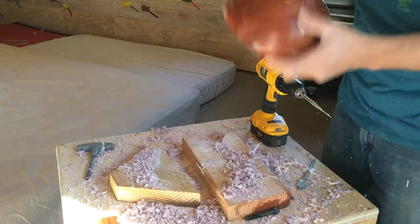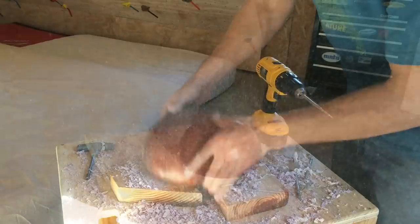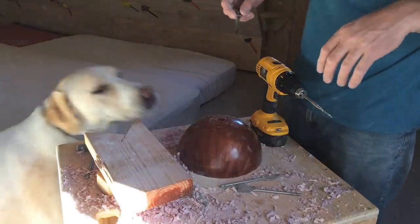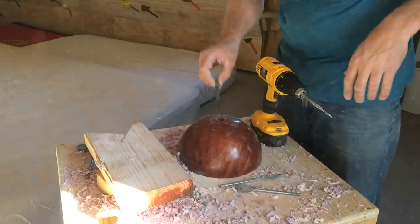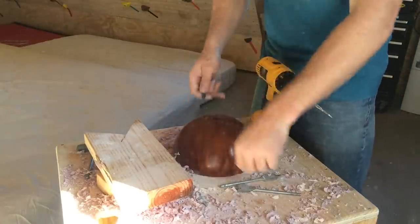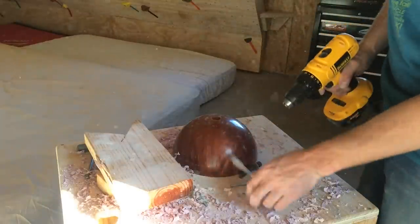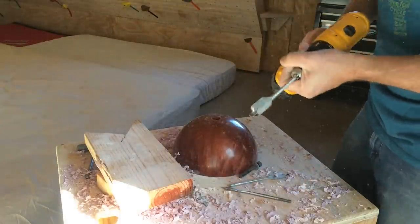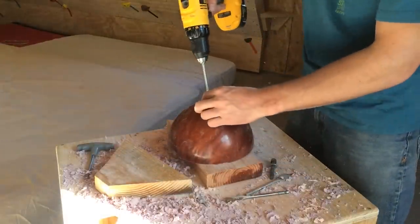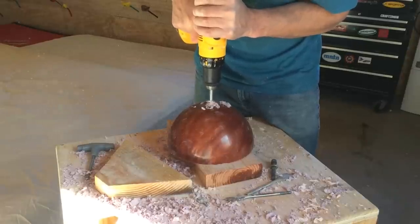It's pretty bomb proof. That is done. I've got the washer. Just going to take the climbing bolt washer, drop it into the hole, get the bolt through. I don't have quite enough bolt so I'm going to hit it again — just put a little bit more depth on it with my first bit which was the seven-eighths. You want to have enough depth to get enough threads into the t-nut in your wall to be safe. It's probably best — actually it's definitely best — if it comes out the back of the t-nut a bit once it's screwed in.